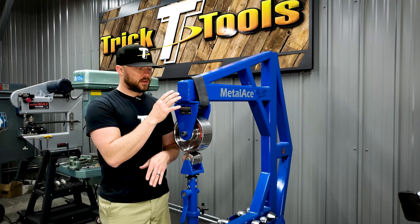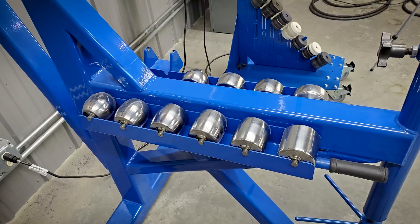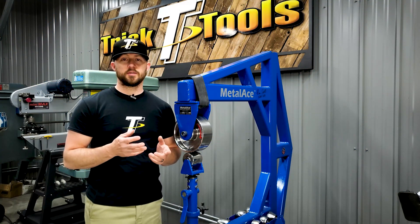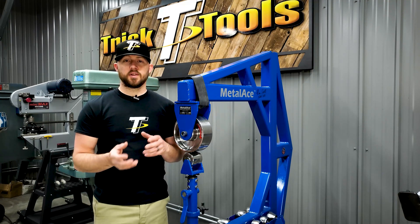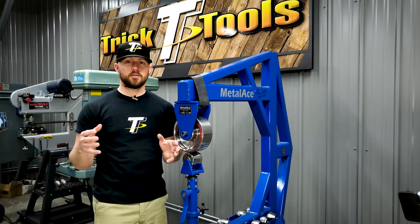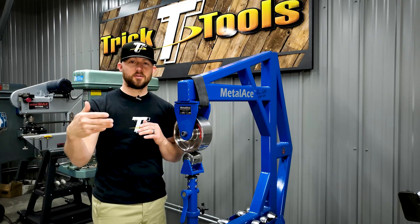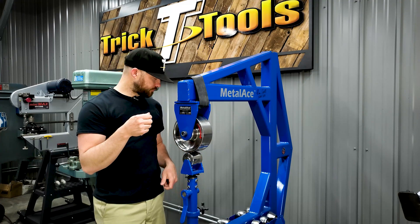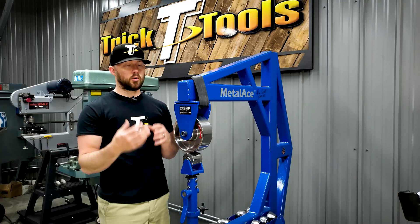The 30F and 44F machines come with the three-inch wide anvils, but you can get the two-inch wide true radius anvils as an add-on accessory. There are different schools of thought, but my view is that you ultimately need both. On a big flat panel like a roof skin, you want to put as much shape in the panel with as little work as possible — the flat spot anvils work great for that.